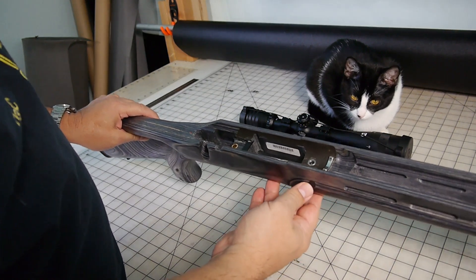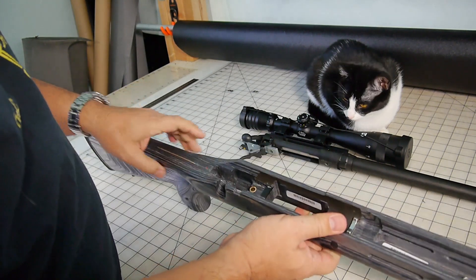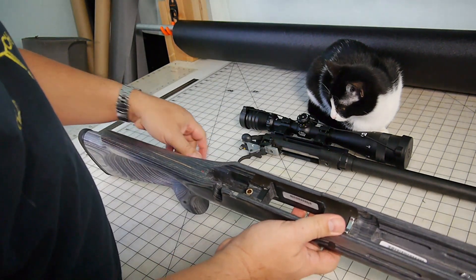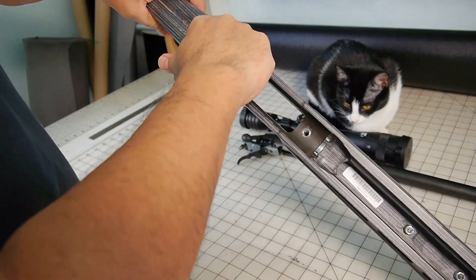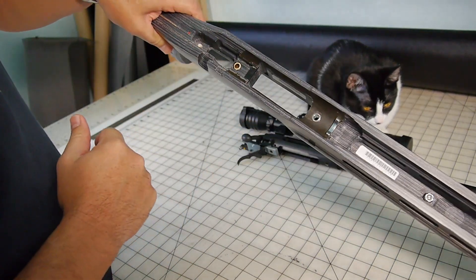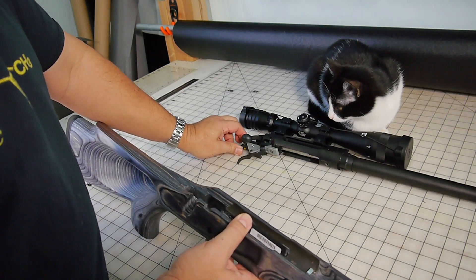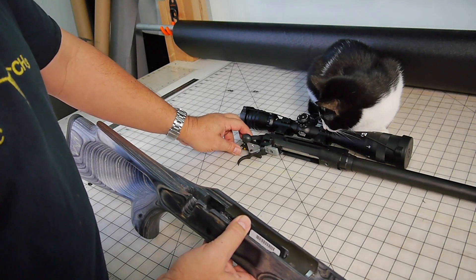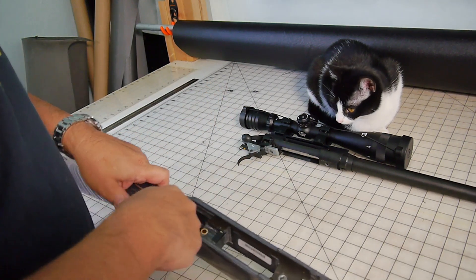The stock was the major upgrade on this whole deal, and you can see I gave clearance for the trigger when I added that cap screw. There was a little ledge on the mounting that I had to file off to give clearance. If not, the action would be jamming and the safety wouldn't work. So I gave proper clearance — that was no big deal.